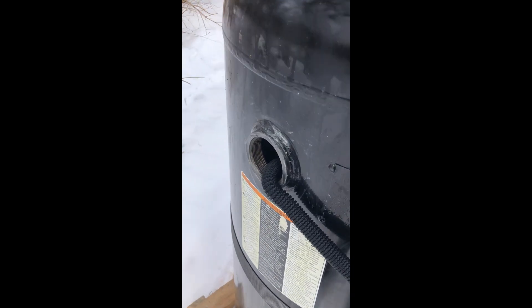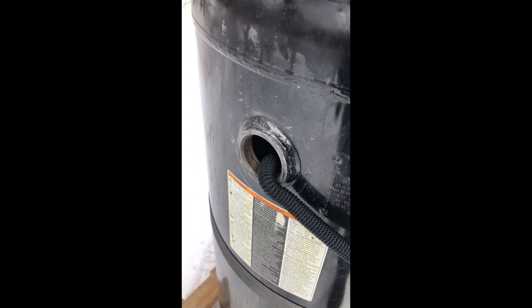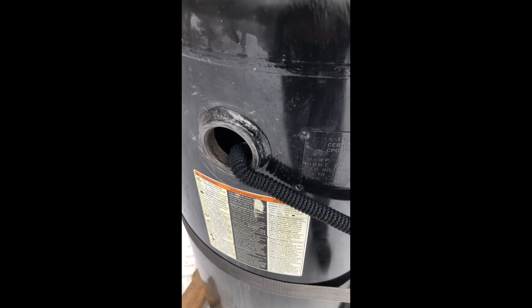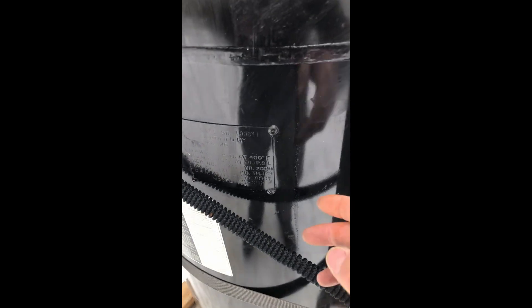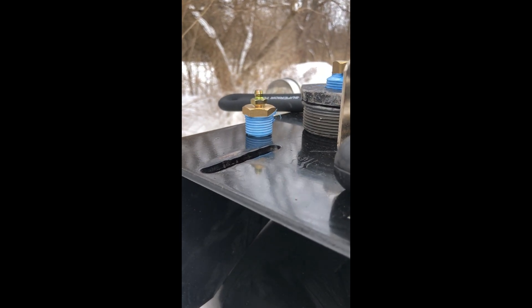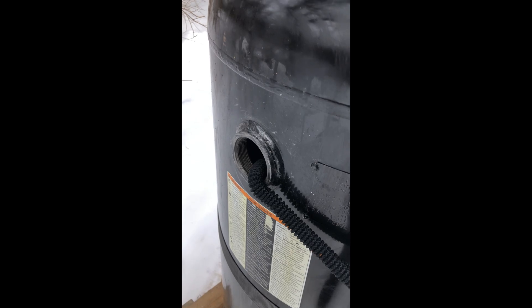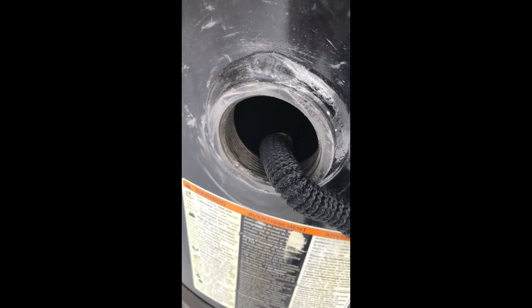Got her filling up — probably gonna be here a while. The whole point of doing the hydrostatic test as opposed to just blowing this up with air is that when a water pressure vessel fails, all that happens is you get a slow leak. At worst, one of these fittings is gonna come shooting out and it's just gonna let down real slow after that. I'm gonna stand so I'm not in front of any of the fittings.